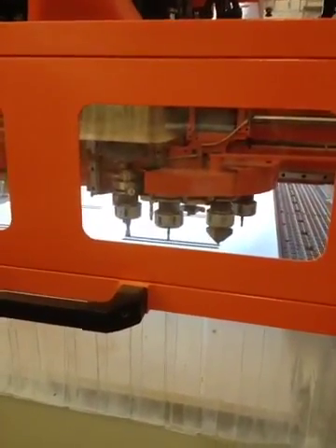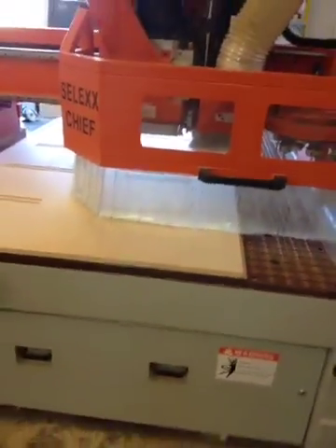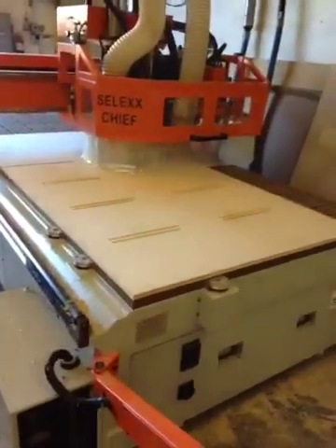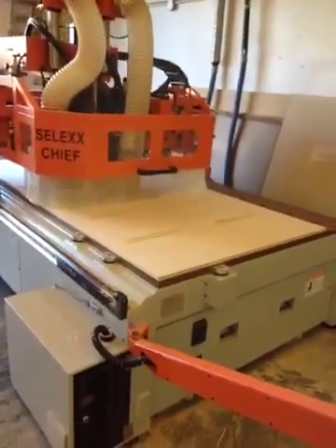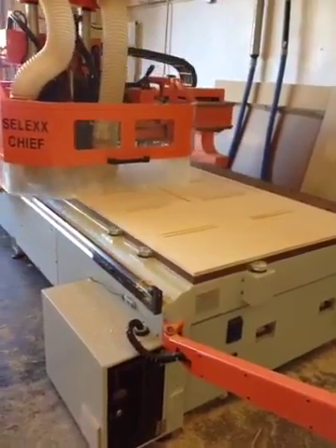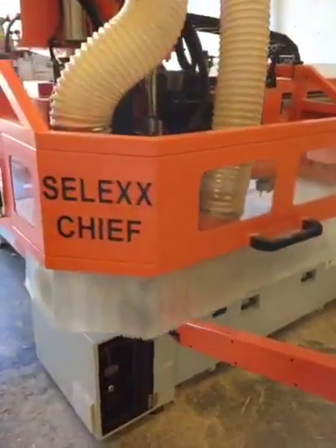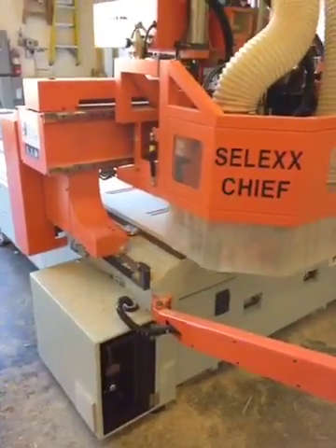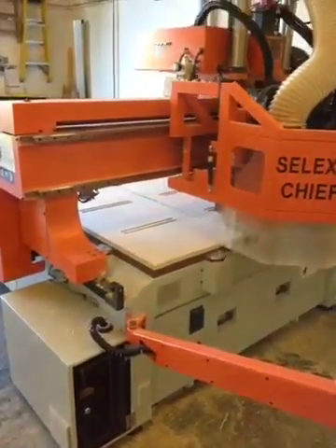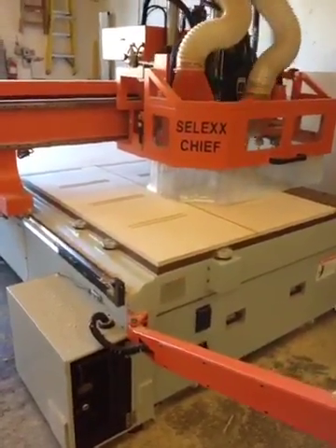Now it's going to change to the outlining tool — a half-inch compression bit that shears up from the bottom and shears down from the top, so it doesn't tear out at the bottom or the top of the sheet. This machine is set up to link the outlines: notice that it went down into the material and it's not coming up to cut one part at a time. It links the outlining together so the machine stays down on the deck and continues around. It moves over about a sixteenth of an inch to get the other adjoining part — so there are just two big rectangles, and it only went down into the material one time.